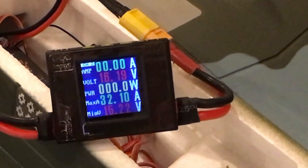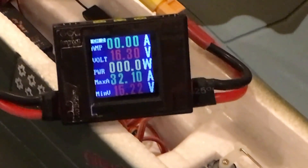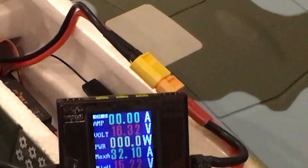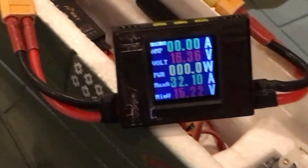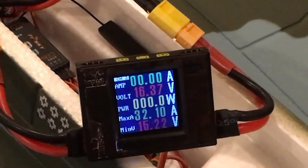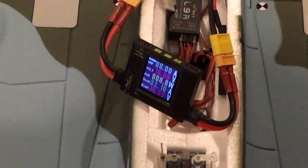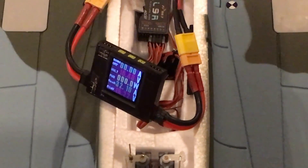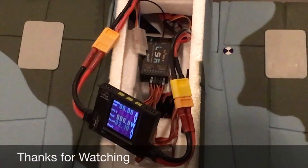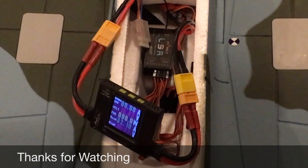Running it again: 29 amps at 433 watts. That's pretty good — it's a 50 amp ESC so I've got a lot of headroom to run it at full tilt for a while. That's a wrap for the Spitfire upgrade video. If this has been helpful please hit the like and subscribe button — it helps my channel show up higher in search when people are looking for this type of information.